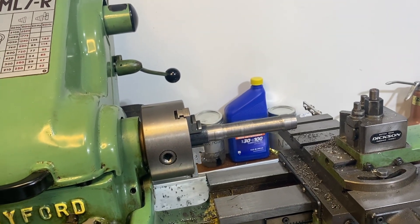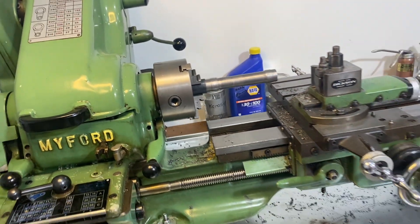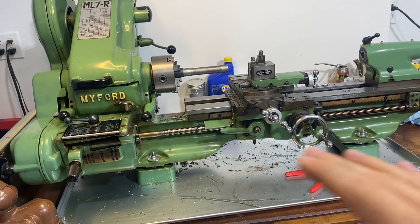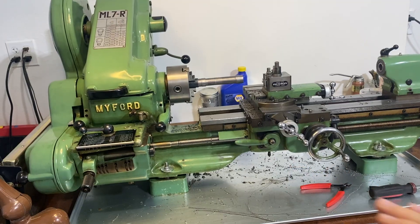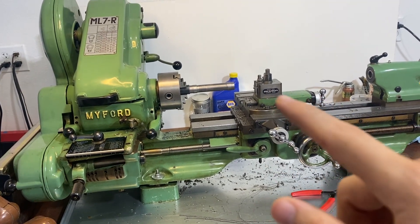It's kind of like a leveling bar, and you need to do this because when you install the lathe on the table, the bed actually has a twist in it. So if the bed has twist, you're not going to get perfectly accurate cuts as you go along the stock.